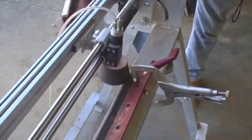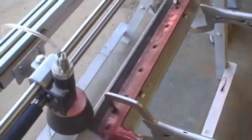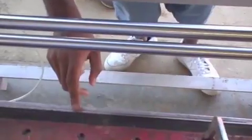Turn the stone on and then traverse. Continue grinding until the front edge of the knife is sharp. Making a mark on the inside of the grinder frame will also aid in future setups.